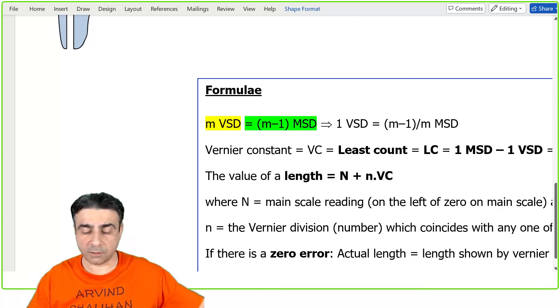So 21.3 mm is the gap between the jaws — the length of the object wedged between them. It's remarkable that hundreds of years ago, someone could invent a way to measure things as small as 1/20th of a millimeter or 0.05 mm. There is also another device called the screw gauge, which can measure up to one hundredth of a millimeter or even less — we will see that next. But first we will cover zero error of the Vernier caliper in the next video.